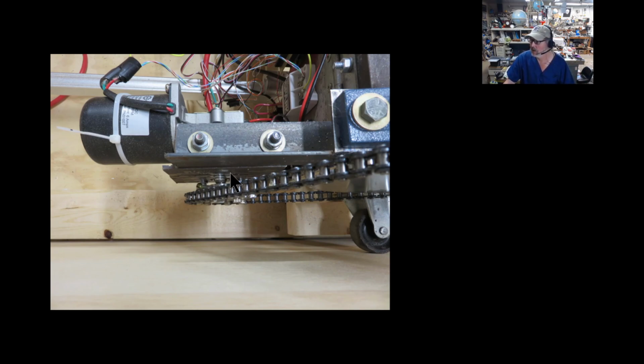So I've not really had a problem with that. And again, I drill my holes a little bit oversized. It gives me a little room to fudge around and push them back and forth. And the pillow blocks are nice because they have an elongated hole, so you can still have a little bit of adjustment where they go to and make sure you're chained. But I would recommend getting some chain couplers and even some chain and a half couplers, so you can actually get increments of how much spacing you need to increase your chain if necessary.